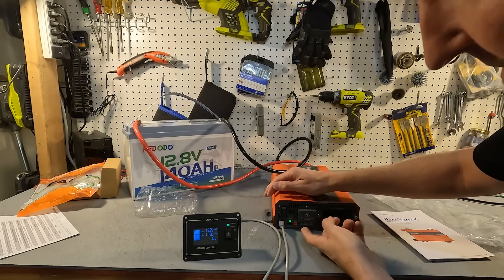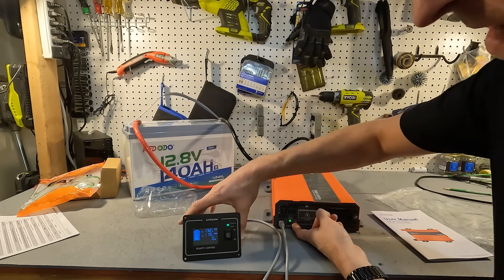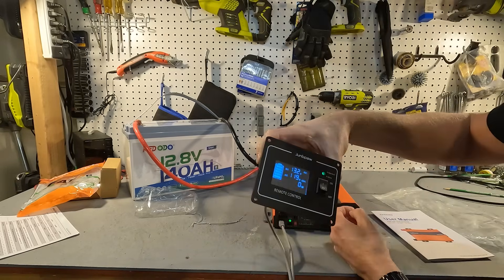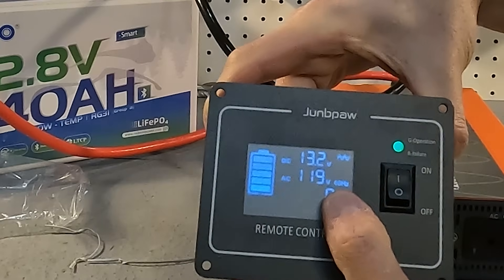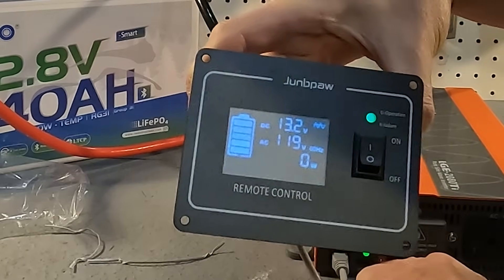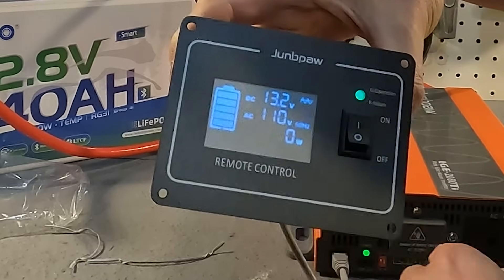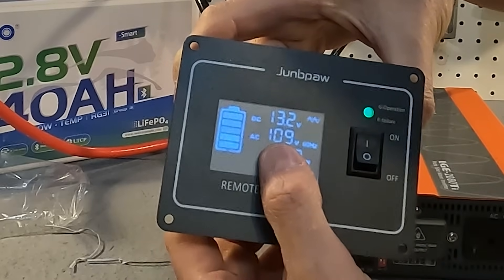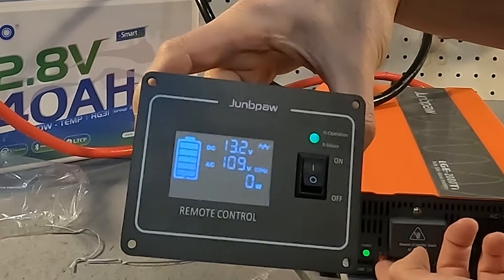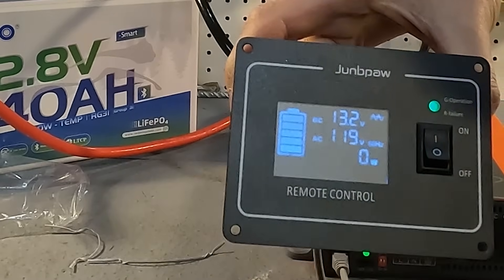It's probably changed with these dip switches. Right now it's set on S2 — let's switch it to S1 and see what happens. Just like that it switched over to 60 hertz when we select S1 instead of S2. And if we go from S3 to S4, the voltage drops from 120 volts to 110 volts. So it's nice that you can pick and choose — I want 60 hertz at 120 volts.